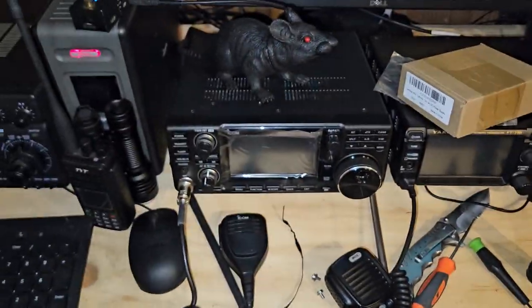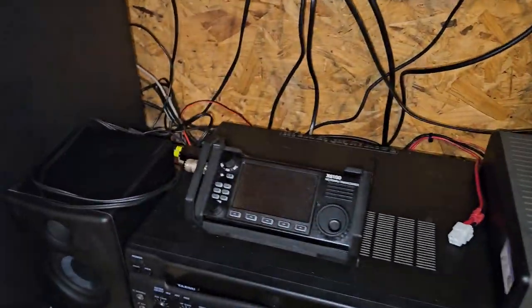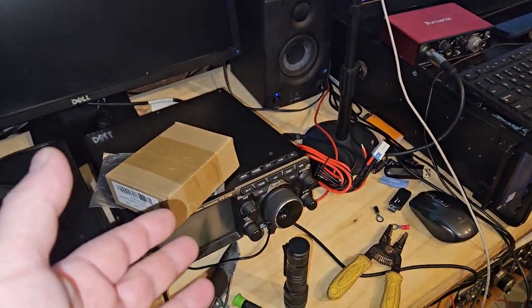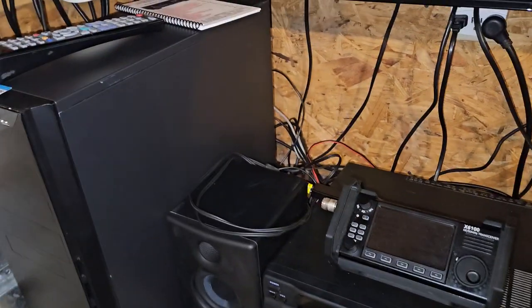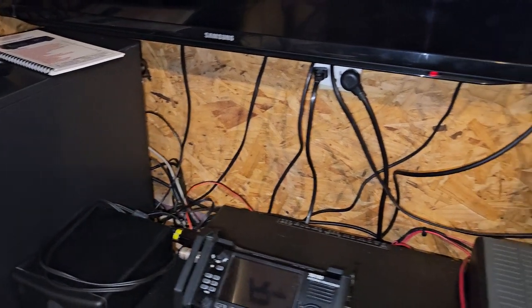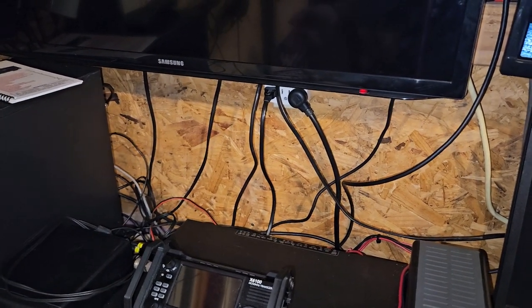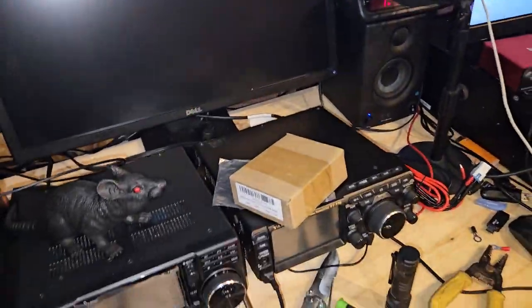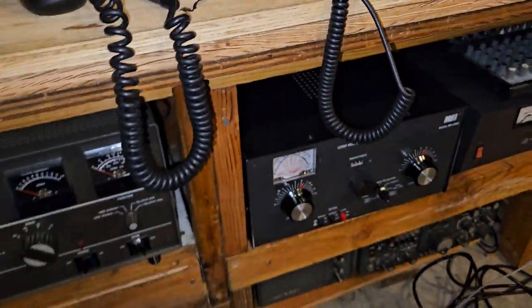Like I was saying the other day, I was on this radio hooked up over here. The 3000 was up here, plugged into this computer. I was originally on this radio and I had zero problems whatsoever. Switched over to here, Windows problems with the USB device, disconnecting, connecting, disconnecting, connecting. Beep, beep, beep, beep. And so that's an RF issue. And if you have a radio and you have coax and you have a tuner, you're going to leak RF somewhere.